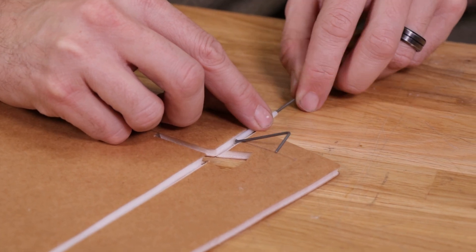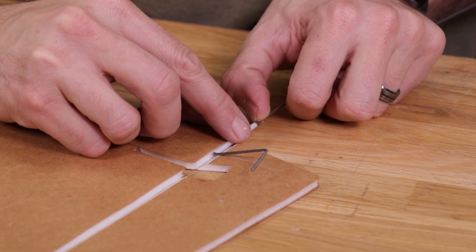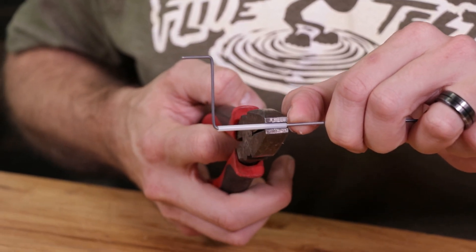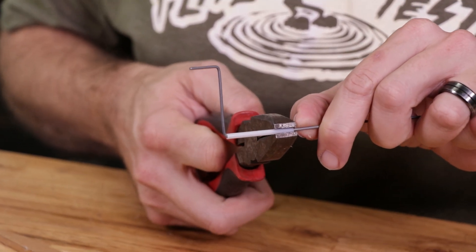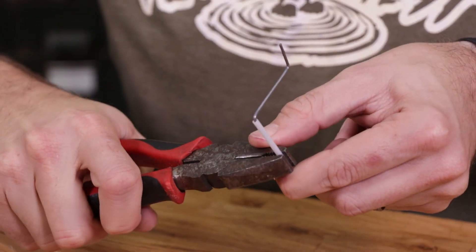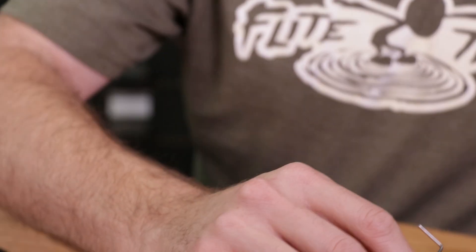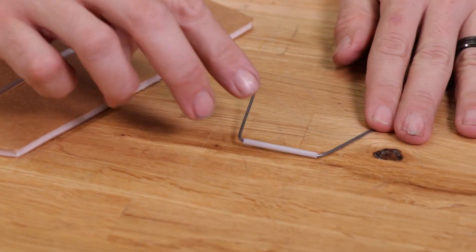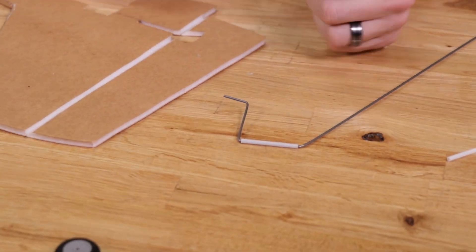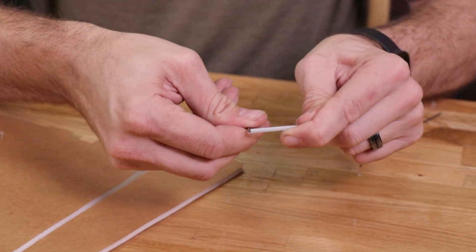Let this travel down just below that wire so it doesn't bind. Carefully grip the tube and the wire, pinching down — make sure not to squeeze too hard — and bend it directly away about 45 degrees. It's a really good idea whenever you make these bends to hold it against the table. If it looks straight up but isn't flat on the table, simply grab the wire and twist with your hands until it lays nice and flat.